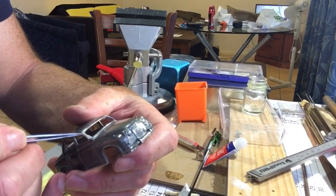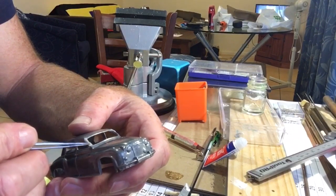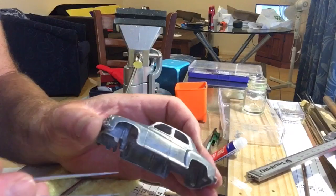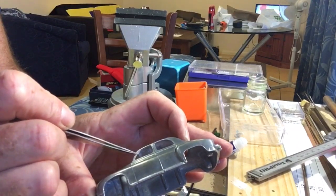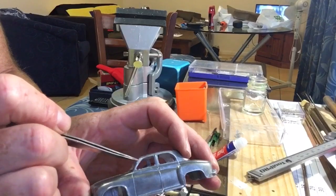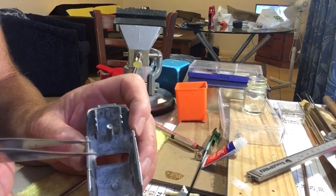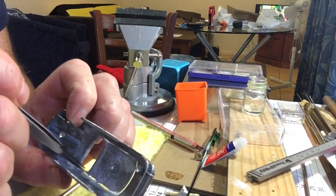So I've replaced the A pillar. That's actually a piece of brass under there, under that super glue and baking powder. And I bashed the brass, shaped it so that it, as closely as I could get it, resembled the shape of the original A pillar. And now I'll sand and file and replicate, as you can see here on the other side, there's a windscreen line, and there's even a drip rail line, or what was the edge of the door or something, on this side. That was the cracked A-pillar there, where I've repaired it there. So I'll replicate those lines on this side, and I'll clean it up inside and out. Because on the inside, it's dished, it's concave on the inside. So I'll do the same as that.